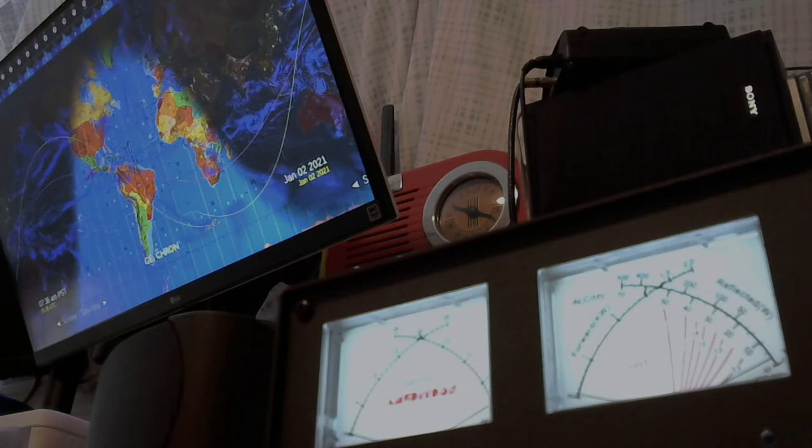Lee, you asked about reflected power. Let me show you real quick my SWR here on this. Here's where we're at. Everything is about 1.2 to 1, so we're good. In fact, I'm running no tuner for this amplifier. It's fully resonant. We're good. It does look like it moves, though. No question. It looks like it moves because it does.